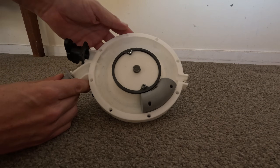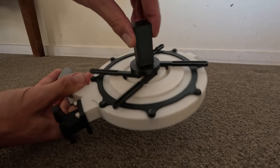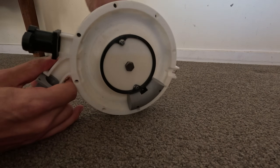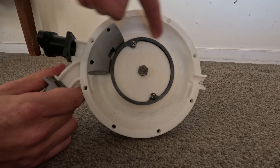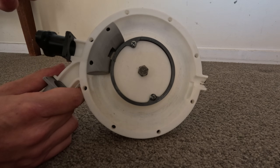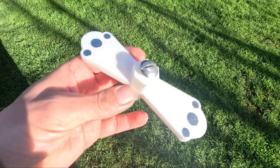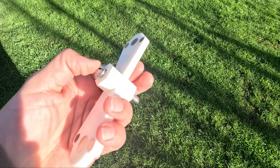So to totally get around the sealing issues, just have a fixed casing with the piston inside with magnets in it, and the magnet moves the piston around. There are issues with heat and you can also get eddy currents from magnets passing through the aluminium, but you could make a little stainless track for it so it wouldn't be affected. You can also buy a different type of magnets — I forget their name — that can take a lot more heat. But will it really have enough torque? I printed this little test jig and put some of these magnets in here to see how much torque it can take.